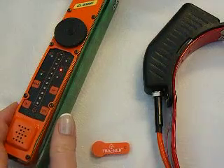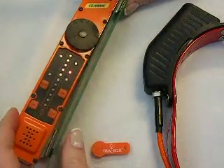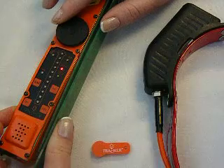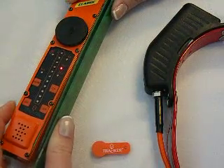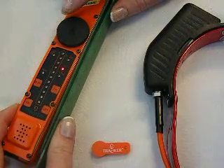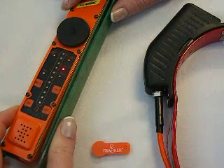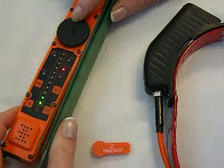Our classics have a tuning wheel on the side that's used to adjust for frequency drift. As you can see, I'm losing range and I have to turn my gain up, and the sound of that signal is changing. I call this kind of a clucky or a chirpy signal. It's really not a very good signal and you will not get very good range with it.